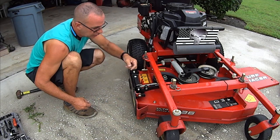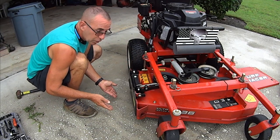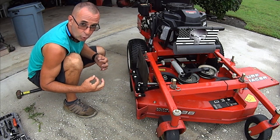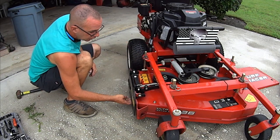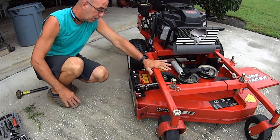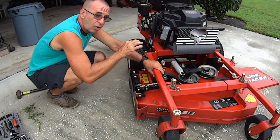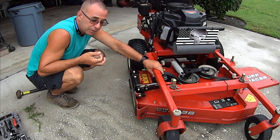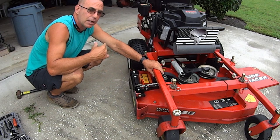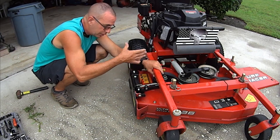I've now made the adjustment so the door sits flat. There's a bolt right here — you tighten this bolt, pull the spring, and it holds the door tight. When you hit it with your foot it opens and holds tight in the up position. If that spring is loose, grass blowing and wind blowing can push the door open and let clippings cough out. That said, there's no level of spring tightness that will stop cross-blading with a whole lot of volume — it's just going to overcome it.